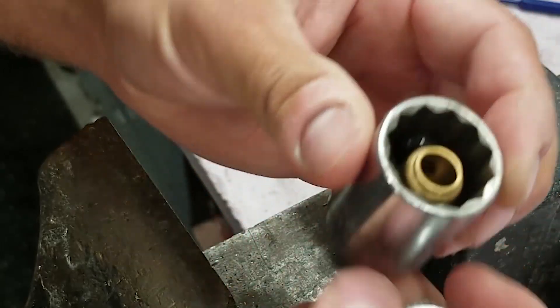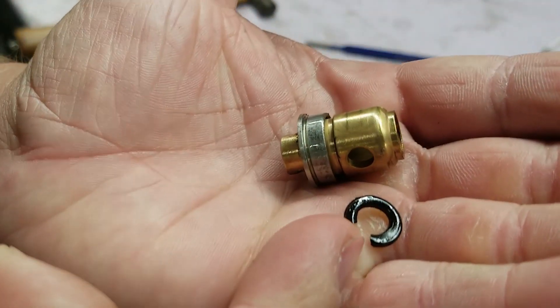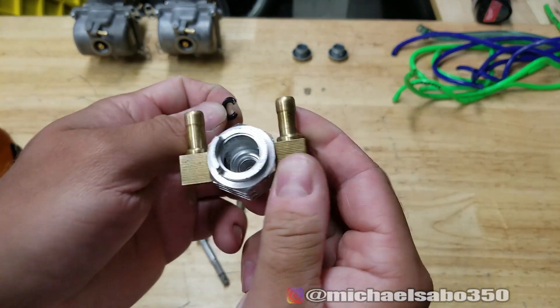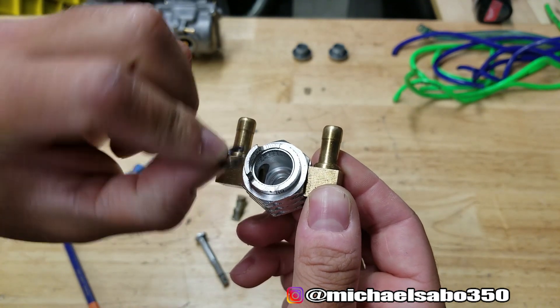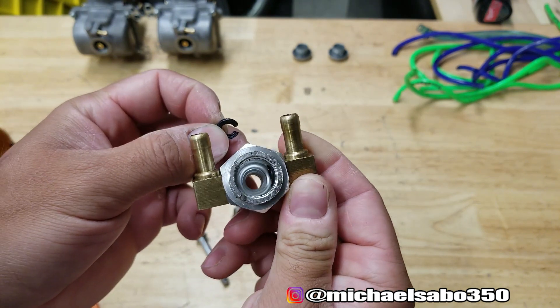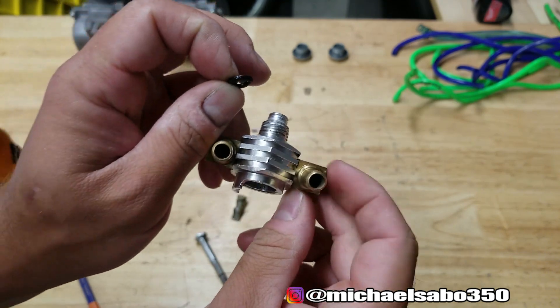There it is. And sure enough guys, we've got a broken o-ring. You can see inside here — there's an o-ring on that side and then missing on this side. That's this broken one. So that was an easy find. I should have o-rings right here to replace those, and then we'll just clean this thing out, press it back together, and that should be an easy fix.